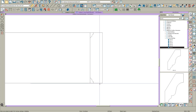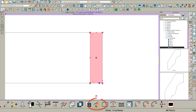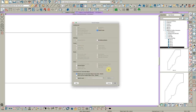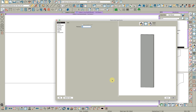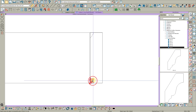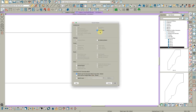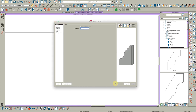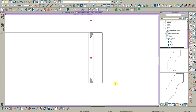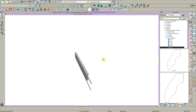The next thing I'm going to do is click on this, go down to this little star shape symbol, and convert that to a polyline solid — making it say 96 inches long. Then I'm going to click on each one of these moldings and convert those to polyline solids, making those 120 inches long. Let's look at those and look at them in plan view.